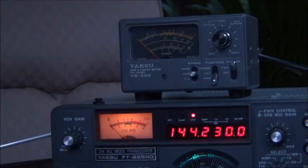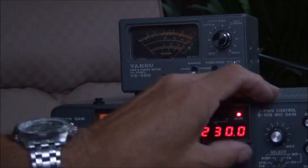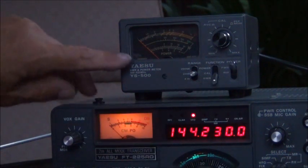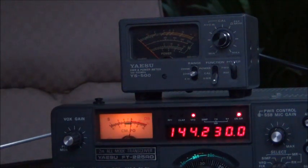I did a few minor adjustments and I've got it pretty good. It's starting to get late and getting a little dark out here. It's been really noisy — cars driving by, airplanes flying over, lawn mowers — so I haven't been able to record. Anyway, I've got it set. Set this on calibrate again — watch this needle, it should go over to the calibrate mark. Very close. I can adjust the power level just slightly. Let's put it on the SWR — it barely moves. You can see the power out. That looks great. N6TWW.